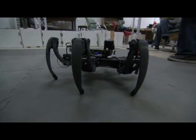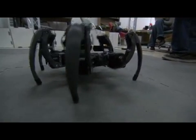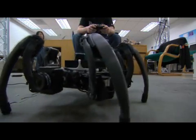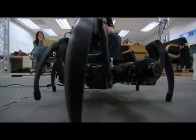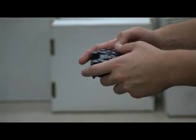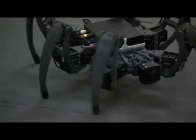The original project started because I wanted the hexapod to actually learn how to walk — I didn't want to program pre-programmed algorithms to move the legs. I wanted it to figure it out on its own. To sense how well it moves around the world, I put a simple Logitech webcam on it and used OpenCV with optic flow so it could get a sense of orientation. That was the main reward sensor for reinforcement learning. I also got a standard PlayStation 3 controller and connected it, which was very easy to use with the Intel Atom processor and made life easy for getting simple control of the hexapod.